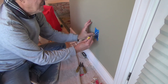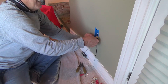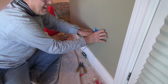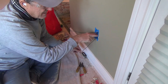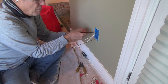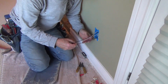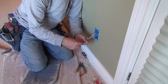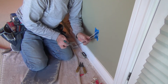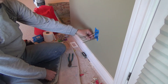Now I push this side in just like I did the other side. Straighten things out, then swivel and flatten the wires back into the box. The wire nut is pushed all the way back, the left wire is a little springy but it's pushing back, and I've got each wire where it goes. I'll trim the black pigtail wires to the same length as the white wires. Now I'm almost ready to put this electrical outlet in.